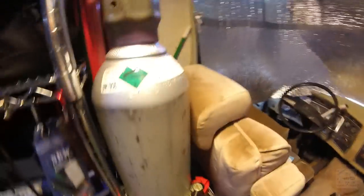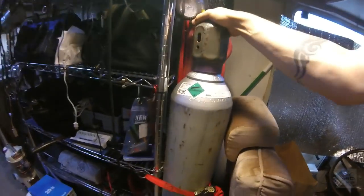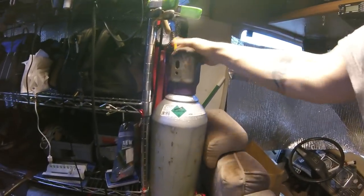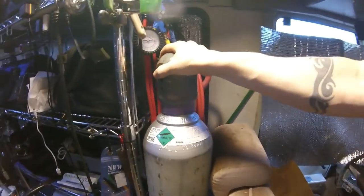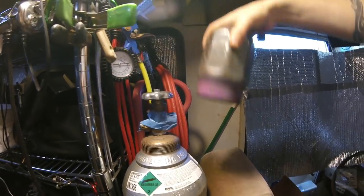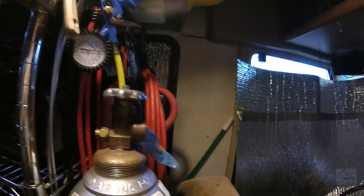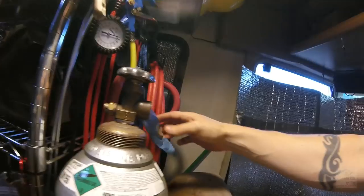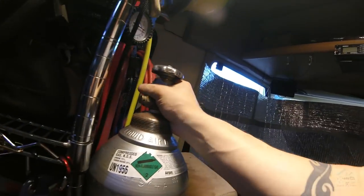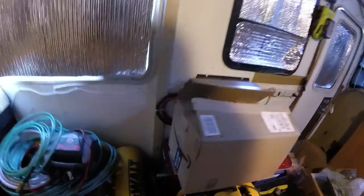Alright, that's where the bottle's gonna go — just use a couple ratchet straps and they're pretty tight, and that's not gonna go anywhere. So that can just stay right there. All I gotta do when I want to weld is take off the cap, put some tape on there just because I don't like dust getting in my threads, put on the regulator, attach the hose and run it out the window. I'm very happy about that — it's gonna make things so easy just being able to leave the tank in here. I got my quick-connect fitting — just a quick boop, attach the line. Love it.